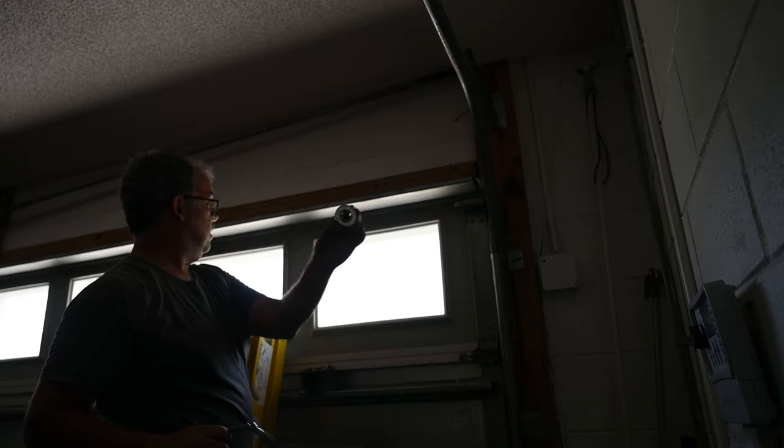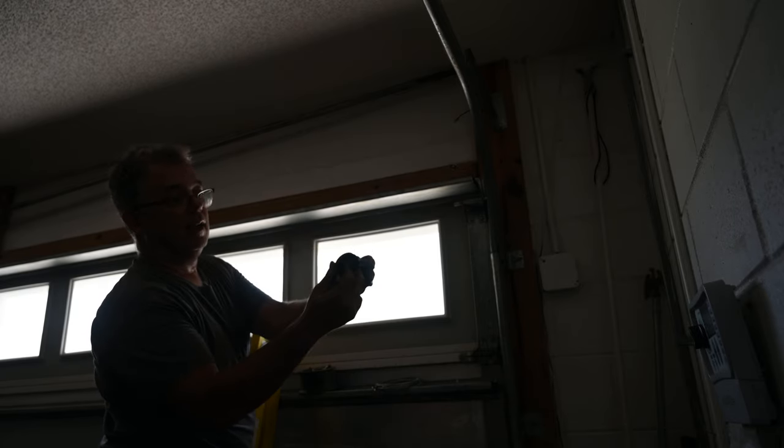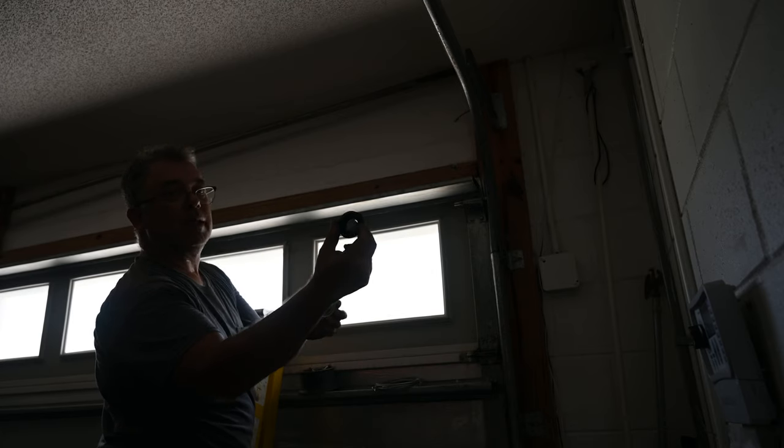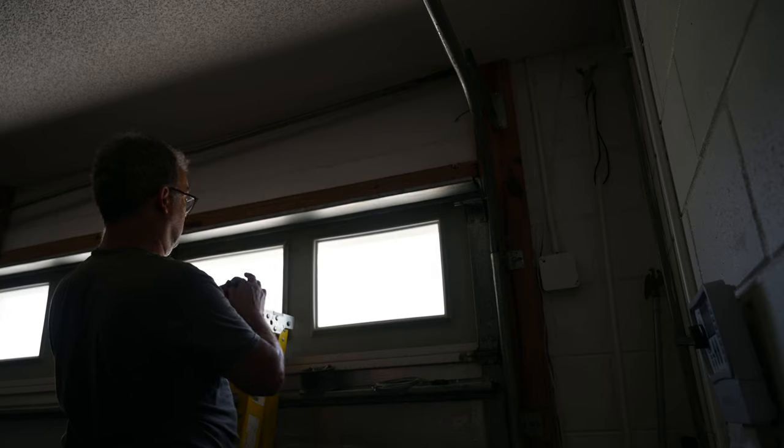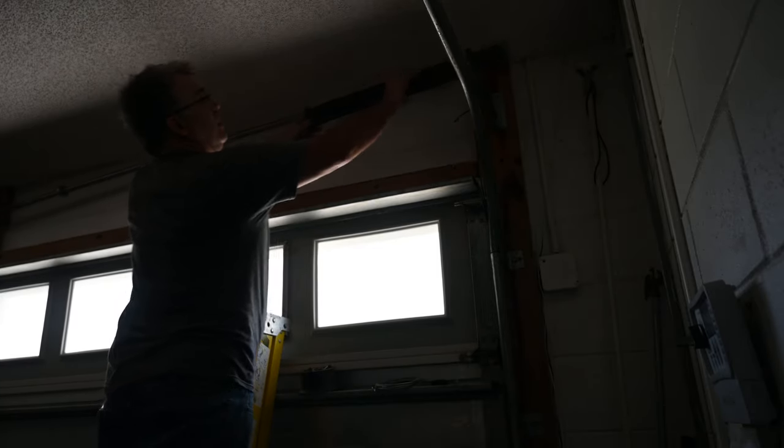So included in the kit is a new cable for this end and a new metal bushing for the center. So you got to put the bushing on. Here's the old bushing. It's plastic, junky, not rated for much. It's not even a bushing. It's just a plastic piece that will basically wear out and cause it to mess up the center. So you slide this on first. Get past the little slide, slide it down. Alright, I'm close enough. I'll tap it past it. Slide the new spring.